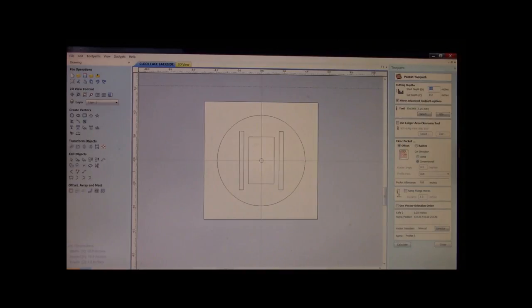Alright. As we stated earlier, doing the face frame, that I use 1-inch thick material. We showed you how to run the numbers and do the math on the calculator right there for you guys to see. Now I know that with my 1-inch material, my blueprint calls out for 3/8 of an inch between the back of the clock face and the front of the face frame. Well, with 1-inch material, it left me 625 thousandths left over. We divide that between the pockets on the frame and on the back of the clock face. We're going to pocket these out, just like the face frame, at 300 thousandths.